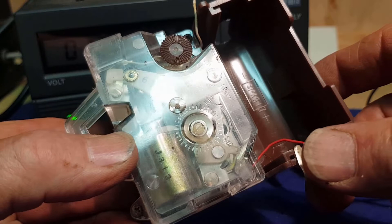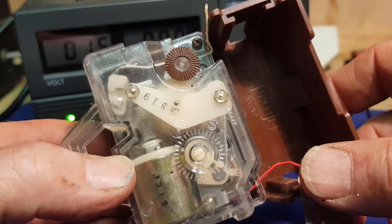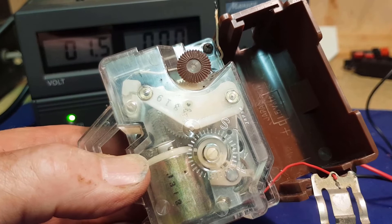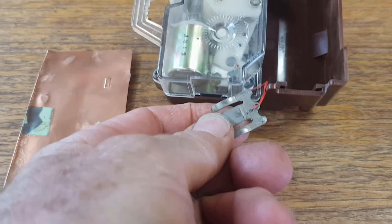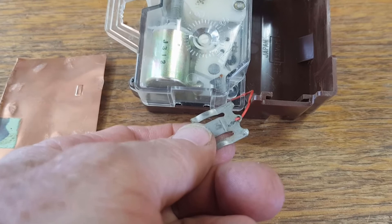You'll notice that even though I disconnected the power the clock's still running - once the spring winds down it won't actually recharge via the motor and it will stop. I'll take it to the shop next chance I get and try to manufacture another plate for it. I had a rummage around at the shop this morning looking for something I could use as a terminal. I did find some stainless steel, some sort of spring steel which would work.